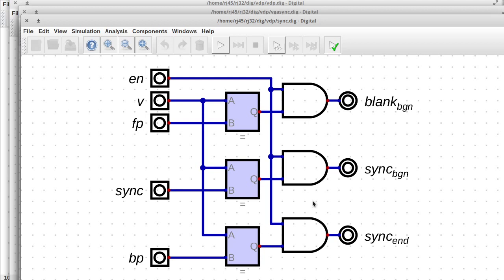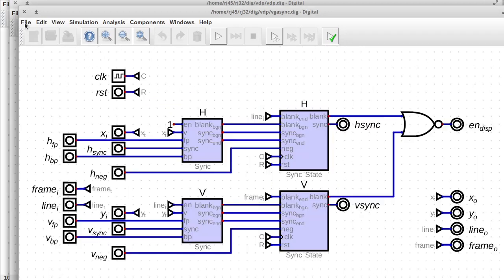And in the original circuit, the video that I linked in the description, I do not have these AND gates, and I didn't find that bug for ages. It all seemed to work in Digital, but when I tried to sync it with an actual monitor in the FPGA, it didn't work. And I was wondering why. It's because of these AND gates. And this is especially important for the Y circuit because enable goes high when there's a new line, but V is going to be equal to the value for the entire row, right? For the whole line. So you don't want to trigger the RS latches until enable goes high, which means it's at the end of the line. So that's what's going on in there.